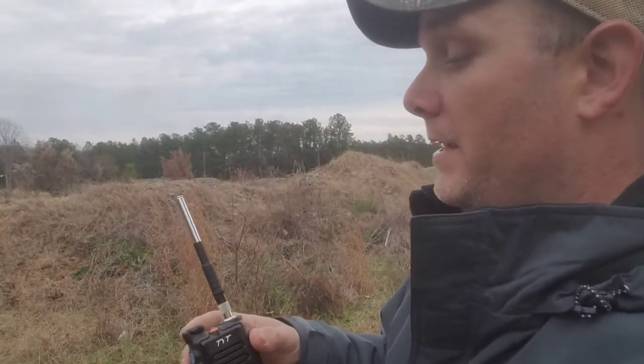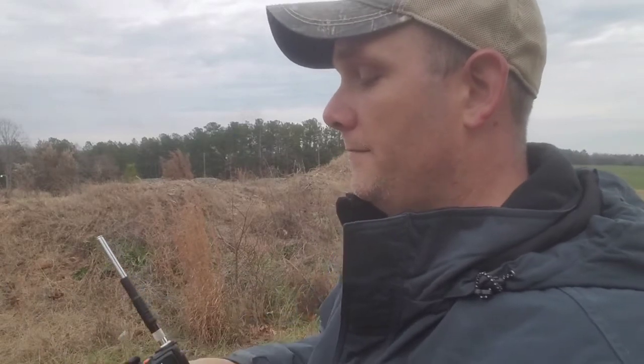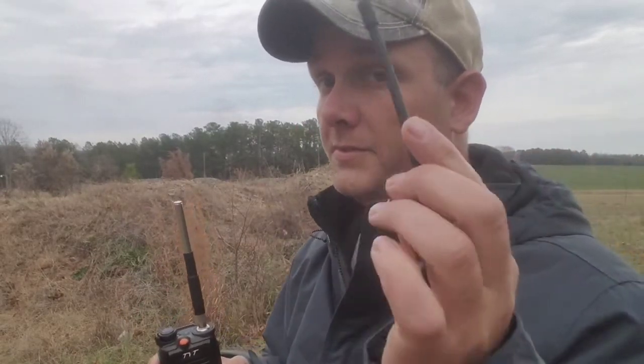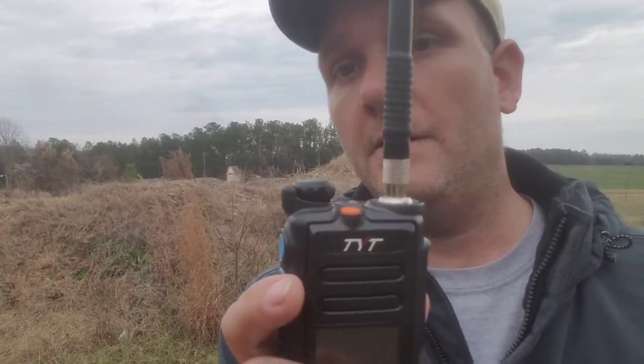That probably was annoying and I'm sorry about that if he's watching. But there was nobody to talk to so nobody was using it. I keep sending my call sign. Anyway, I was looking at the RSSI and I proved to myself that the dBm is a little bit better with this antenna, even at a quarter wave, than the stock antenna. Now this is a fabulous, really good antenna — it really is. Anyway, that's what I did. Hit the like button — you don't have to — but hit the subscribe button and look at the links down below. You're going to Amazon.